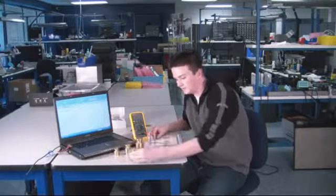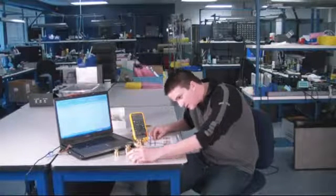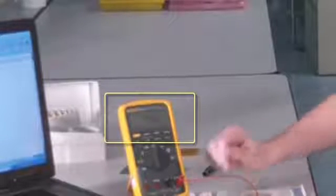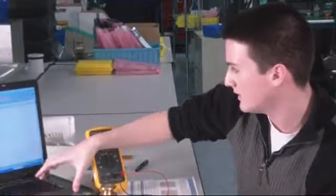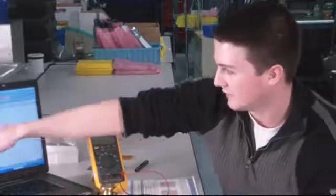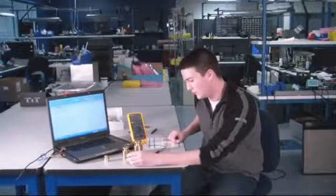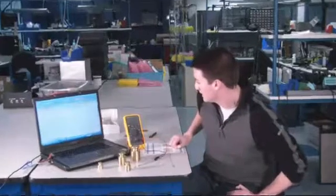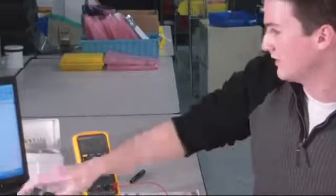First, I'll start with the lowest load and place it on top of the puck, making sure to balance it so that it does not touch the table around the edges. Wait a few seconds to settle and the resistance output is showing about 76 kilohms. Enter 76,000 into the spreadsheet and that is our first data point. I will place the 200 gram weight on the sensor, make sure to balance it again, and let the reading settle. The output is about 44.5 kilohms.